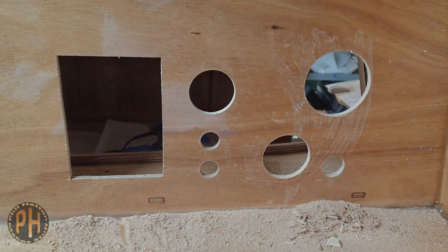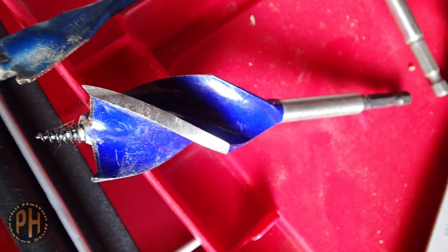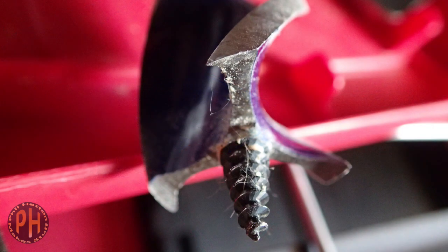Those are great if you want to drill a hole in a 2x4. If you want to drill a nice, neat hole in marine-grade plywood and you are able to do a good job with one of those, congratulations — you're much more skilled than I am. You probably do this for a living, and you should definitely have your own YouTube channel so I can watch and learn. Tri-flute bits with a similar screw-threaded point are also the worst — just as bad as the spade bits or any other self-feeding bits.